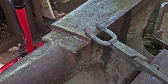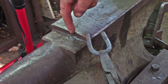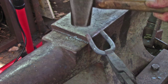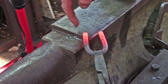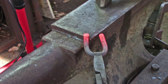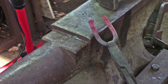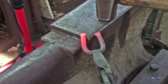When I'm ready to make my chain step scarf, I'm going to come here and you'll notice I've got the outside corner in line with the step and I've got the chain material at about 45 degrees. What I'm going to do is hit and then pivot. As I bring material in, it's going to come out with the edge of the stock in line with the edge of the anvil, and I'm going to hit it. That's going to make a step, and I'm going to pivot off the back side as I slowly rotate — pulling that lozenge shape out towards the center of the U. I'll park the outside corner in line with the step, give it a blow, and pivot off this inside corner.